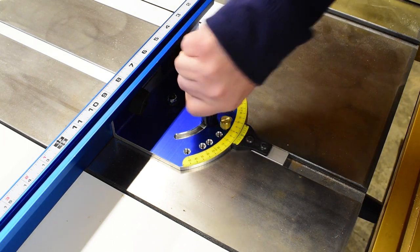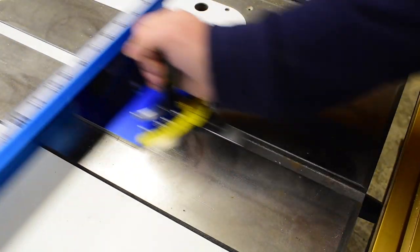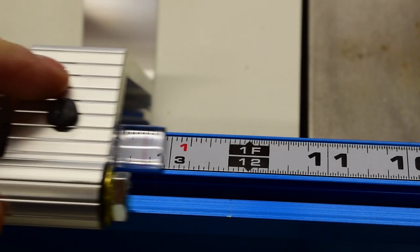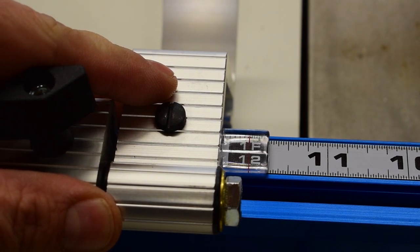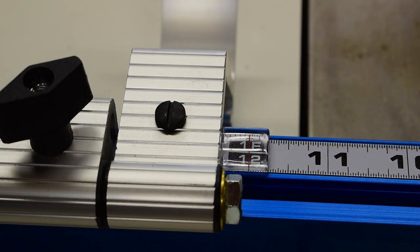This bar is also used to actually tighten the rotation of the miter gauge, and it moves back and forth super smooth because I just greased up my table saw. Then we are going to put on the flip top stop — it just runs into a T-track. The plastic screw here moves the indicator window, so be careful not to over tighten it because it will snap off.